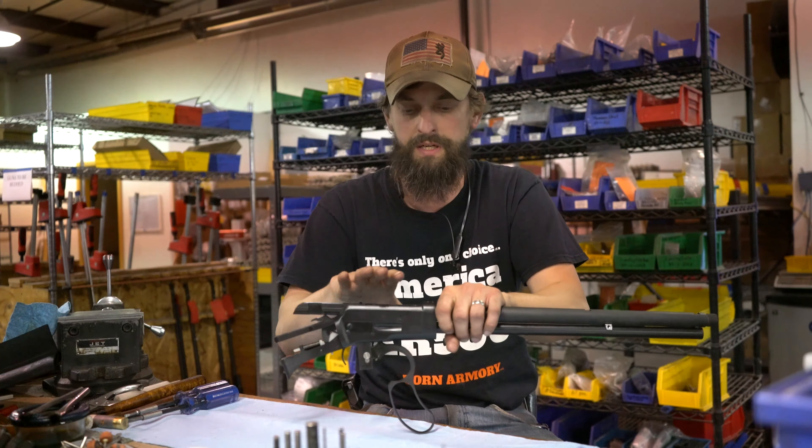The 500 Smith is too large to fit into a standard Model 92, which is the Winchester pistol caliber gun. The 86 is their rifle caliber gun. So we kind of met in the middle with a scaled-down 86 receiver size but a lengthened set of Model 92 internals. The two really large locking lugs — fitting recesses in both the receiver and the bolt — provided us the surface area we needed to prevent that headspace measurement from stretching.